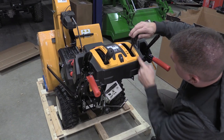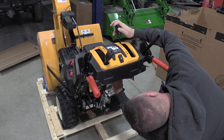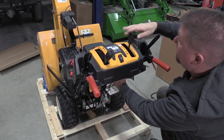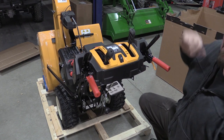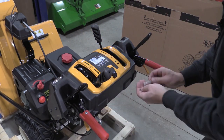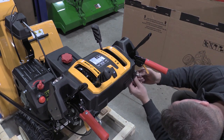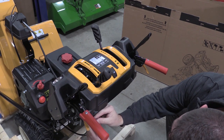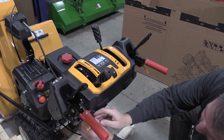We're at one of the final steps here. Take your speed lever, push it all the way forward — this piece that's hanging is going to slide up into that hole. Just jimmy that around, then put your pin in. From there, you have your reverse and forward speeds all set up. The last thing we're going to do is take our shear pins, put them in the holders — there's one on each side — and then slide these pins through. In that case, if we ever need them, they'll be right here and ready to go and we won't have a stop of usage.